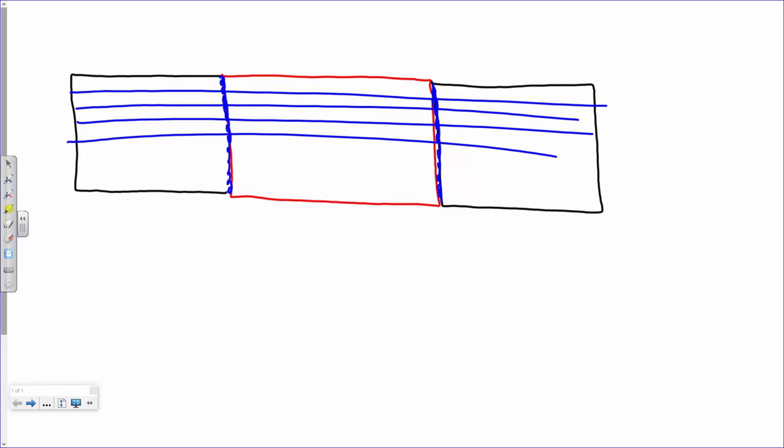To perform these welds, first off, you have to do a bunch of surface prep. You have to weld on what are called runoff tabs. They're going to weld from end to end, so you have to have a little piece of steel at the very beginning to catch the rest of that metal. Then they grind these off and cut.